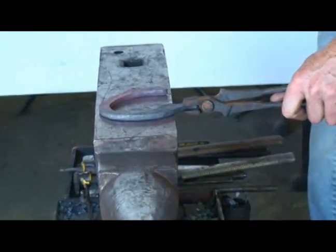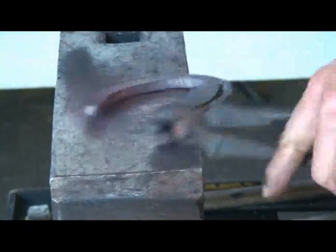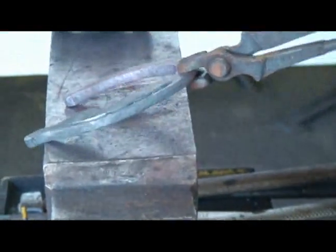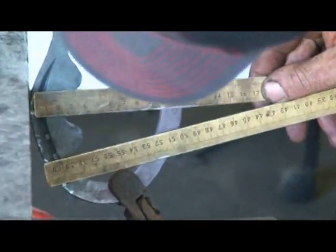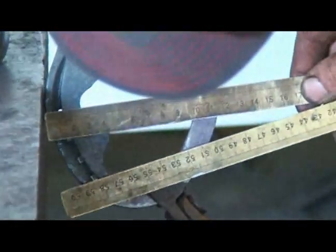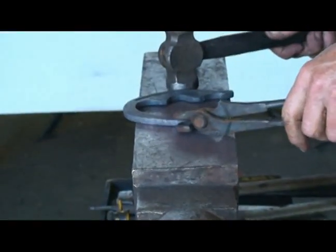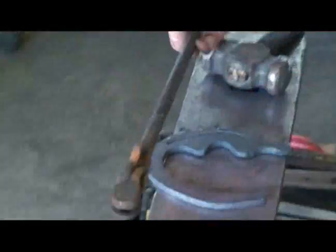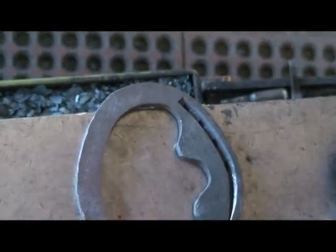Before I commit to that inside toenail, I want to figure out my width. Am I all right as far as... I'm right at 120. So I think I'm all right to go ahead and mark my toenail. Line up with the base of the anvil with the other toenail. So I'm going to line up my toenail there.